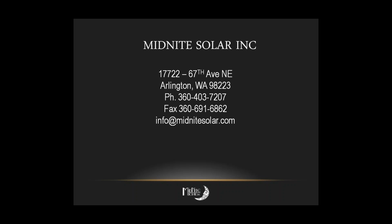Okay. Excellent. Yeah, especially on the 520 amp hour battery bank, it's big enough that if you don't get much past like a C10 charging rate, that's around 50 amps or so, then you're probably fine, and you've got the potential of 30 off the KID. I don't know what the thermoelectric is capable of doing. Do you know? I want to say it's only like 10. Oh yeah, so you're well within that. You're not going to exceed the C10 rate. No, that should be fine.